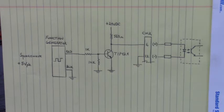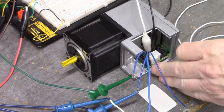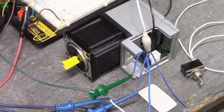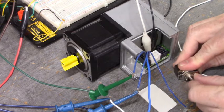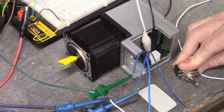Let's go back to the stepper motor drive and see if we can reverse direction. With no voltage applied to pin 5 of the CN2 connector - no plus 24, with pin 11 being ground - those are the anode and cathode inputs to the direction optocoupler. With no voltage applied, we're running clockwise as looking into the shaft of that motor. Now let me apply plus 24 volts DC to CN2 pin 5 - and now we're running counter-clockwise. So 0 volts on pin 5 is clockwise, and 24 volts on pin 5 is counter-clockwise.